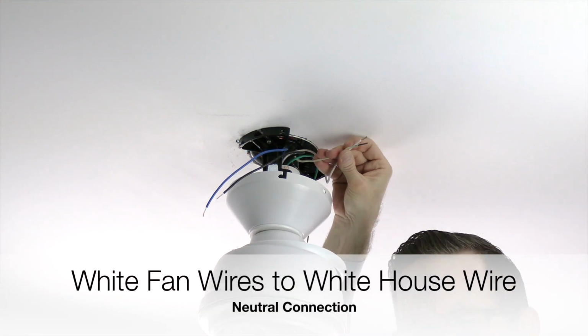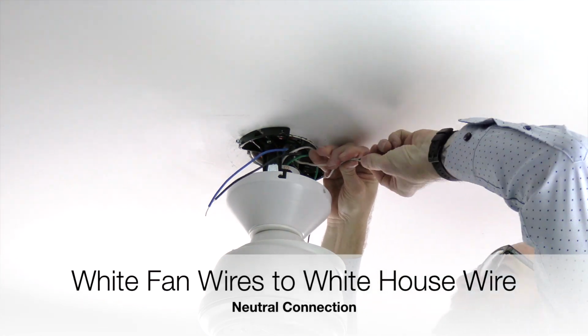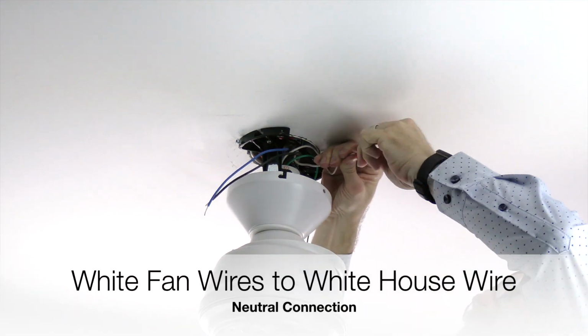Next, take the white wire from the fan and twist that wire together with the white wire from the house. This is the neutral connection. Secure the connection using an included plastic wire nut and a piece of electrical tape.